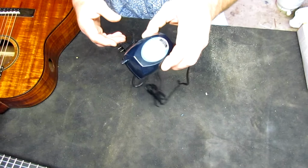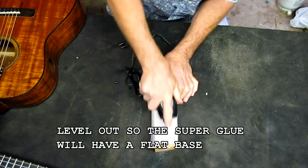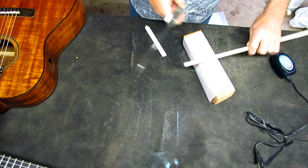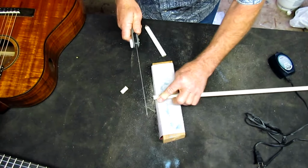Now, I'm going to take off these little knobbers. Okay. I'm going to take this sandpaper, my 80 grit sandpaper. I'm going to sand that down nice and level, just where those knobs were. Okay, next, I'm going to take a half inch dowel, my little saw. Okay, and then we're going to take that dowel, cut it into 1-inch pieces. Got 3 of those.